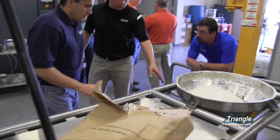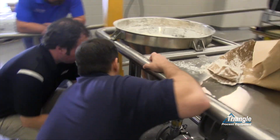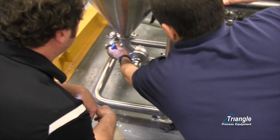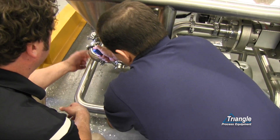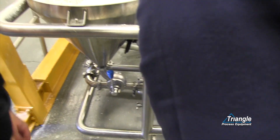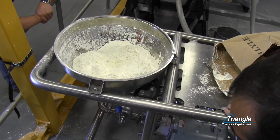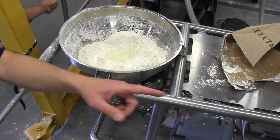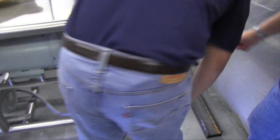When you come back around, what I'll usually do for cornstarch is run with the hopper about half open. To open it, lift the handle out this way and then rotate it so it's vertical. Pull it out of the divot and then rotate — straight up and down is 50%, because we're at 45-45. Once it starts to flow, turn on the vibrator. That's the switch that says vibrator.